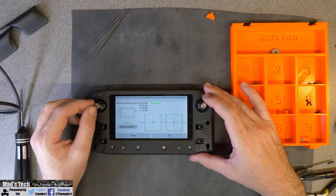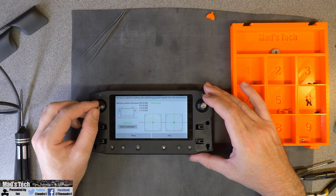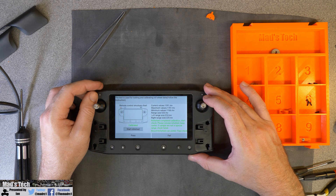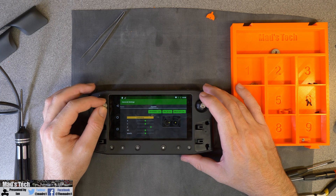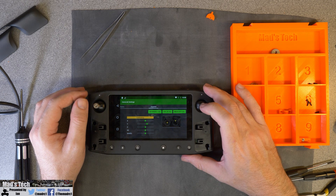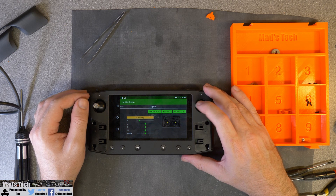Once complete, you simply reassemble the remote controller and then perform the main stick calibration process again to make sure everything performs as expected. Do both the main gimbal wheel as well as the main gimbal sticks, and check that they perform as expected in both the standard outputs and the S-bus outputs as well. If you do get any problems, simply perform the calibration again and everything should work as expected.